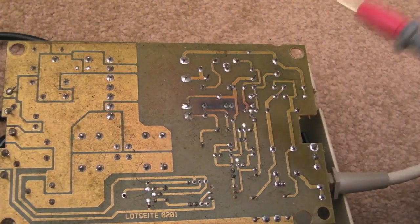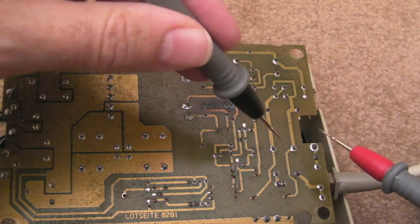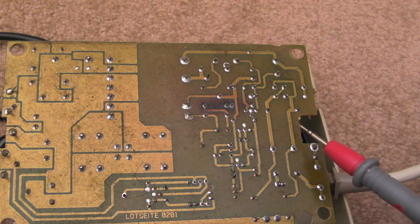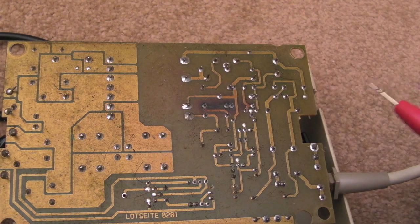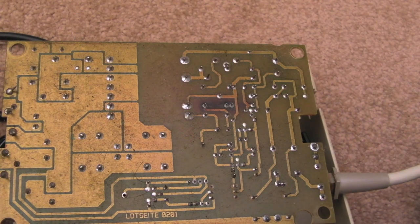In the UK, you know, obviously in other countries it might be a bit less, but nevertheless, if you were to accidentally put your fingers on that capacitor straight after having run this power supply, it will give you an electric shock, quite high DC voltage. There is a resistor there, let's say, to bleed some of that voltage away, but it would take a period of time for that to occur.